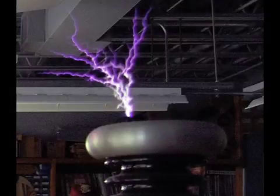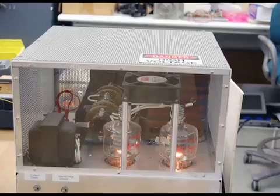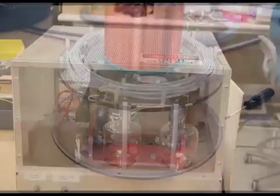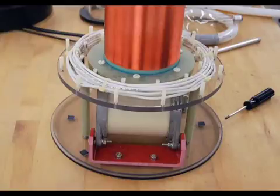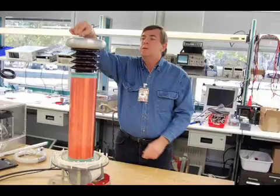So, what does any of this have to do with the cool purple sparks? Here's where it gets really interesting. This power supply, which feeds the capacitor, has a resonant frequency — 200 kilohertz, or 200,000 cycles per second. This tuned circuit has a resonant frequency too: 200 kilohertz. And this large coil, which is part of a second tuned circuit in this instrument, has a resonant frequency as well — approximately 200 kilohertz. With a Tesla coil, what we're doing is exciting the natural resonant frequency of the secondary coil. Together, the two tuned circuits create a special type of transformer called a tuned resonant transformer.